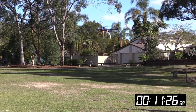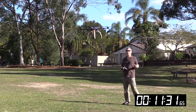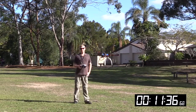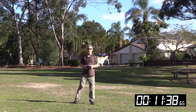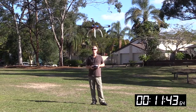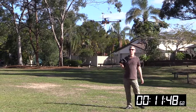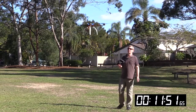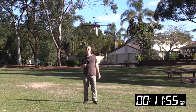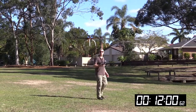Just got 11.5 minutes — we've exceeded the E-Calc suggested hover time, I'm quite happy about that. This is only the fourth time I've had this thing up, so the LiPo batteries are reasonably fresh. I actually bought two brands of LiPo batteries — the Turnigy and the Zippy. It's pretty hard to find decent reviews on these batteries; you'll always get fan clubs for one particular brand or the other, so instead of buying two of the one brand, I thought I'd try one of each.